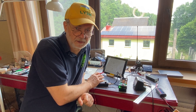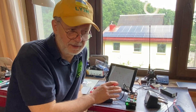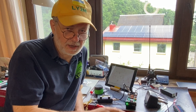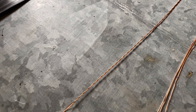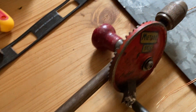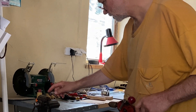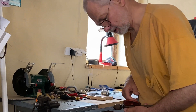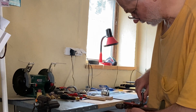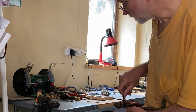There are some tips in the assembly manual on how to make bifilar and trifilar wire. I used my small drill — let's jump into my garage and see how I did this. To make bifilar and trifilar wires for transformers T2 and T1 is not really that difficult; you just need some skills and tools. I use my mini drill and a vise. One end of the trifilar wire goes in the vise, the other in the drill. Now slowly but reliably rotate the drill until you have the desired result. No need to hurry.